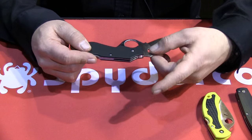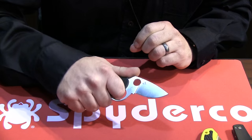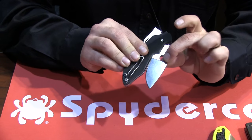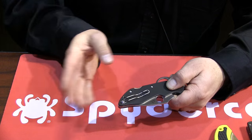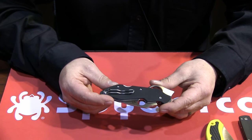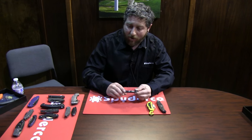There are some little features we added for touch — like we chamfered the inside of the hole, we radiused the outside so it feels good in the hand. The back lock is going to give you a very secure lock. Great self-close, made in VG10, full flat grind, G10 scales, wire clip, lanyard hole. It has a lot of the very nice features you look for in a Spyderco with some nice added design. So this is designed by Chris Knutson — called the Introvert.